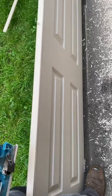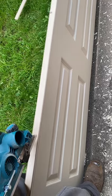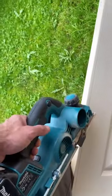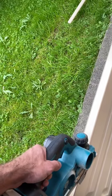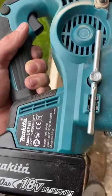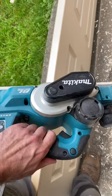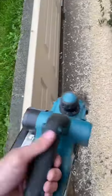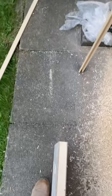Because I built the frame to which these doors are going in, I know the door legs are going to be nice and level with an equal gap. All I need to do is take approximately eight millimetres off the width of this door, just to allow enough passage from the other door. What I've got here is the Makita DKP181 brushless planer — I'll quickly show you this in action. Makita is by far my preferred brand of power tool.